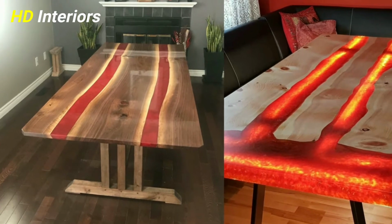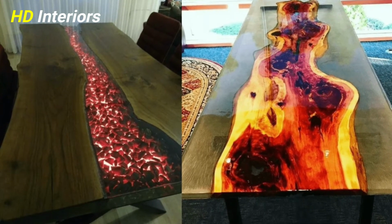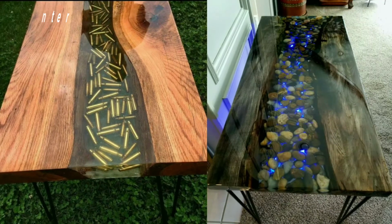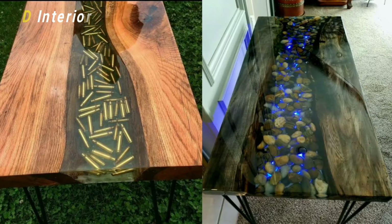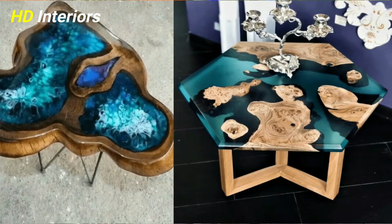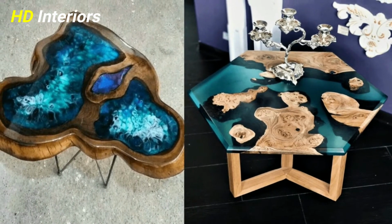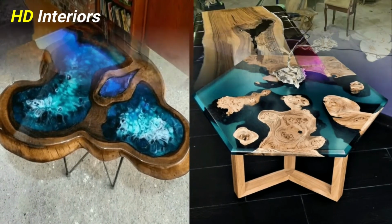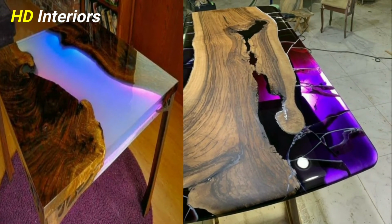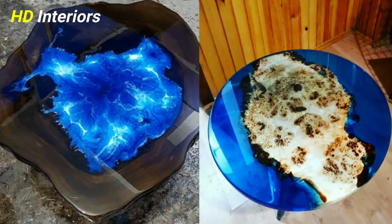Even if the room temperature is an ideal 20 C, if the temperature drops significantly towards the floor, the thermometer should only show 15 C to 17 C. If the epoxy resin were to be stored on the floor at these temperatures, tiny, unsightly bubbles could quickly form in the resin. These cannot be removed very easily, even with a hot air dryer. Therefore, it is better to store the material on a workbench or shelf. Another important factor is that the work area should also be a dust-free, dry, and well-ventilated setting.